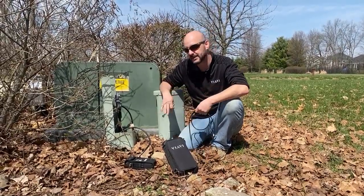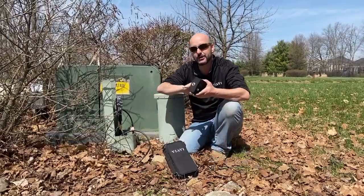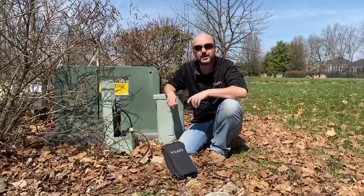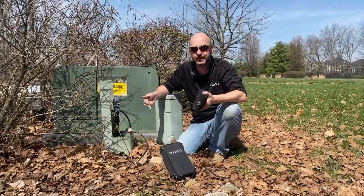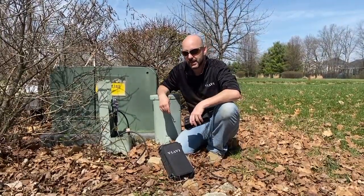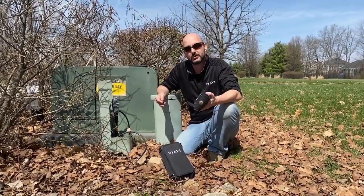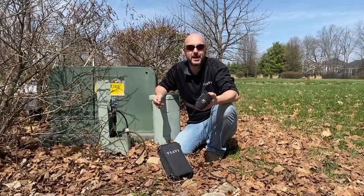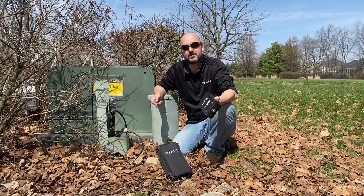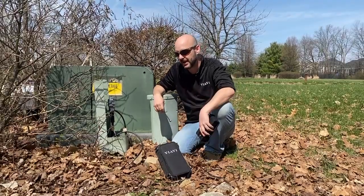The beauty of this test is that it's very simple and straightforward — it was literally just hooking up a transmitter, plugging an antenna on the meter, and using my feet to walk down the leak. If I hear any sounds, that's going to guide me right to where the leak is actually coming from. This can really help technicians get to the leak or shielding impairment much quicker than traditional methodologies, because we're using sound to guide us to the problem.